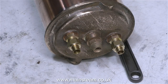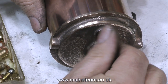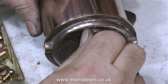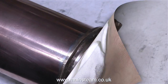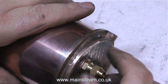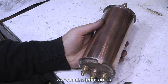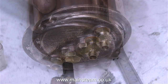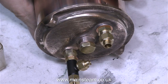It's looking good. This is the action end — the water inlet and outlet, and the steam outlet in the centre. Over now to the other end — I'm just putting a plain fitting in for the moment to see what happens. This is just my idea of feeding steam into this: as the condensate level inside the tank gets past this union, the steam will make that funny noise that steam makes when it's pushed into water, and that will tell me it's time to open the drain tap and empty the condensate from the tank. And talking about drain taps — I'm just fitting this one, using some Loctite 542 because I don't want it to leak. This clip shows the tap finally fitted in place. I'm glad I opted for this size — it looks quite neat.